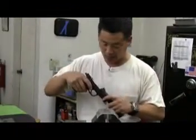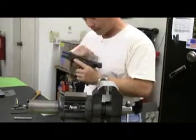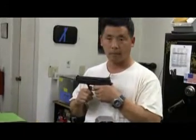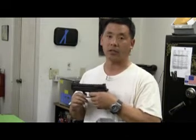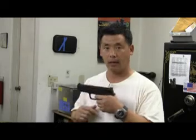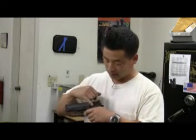Now we can reassemble the slide assembly and just check the function. So when I release, you can hear it, but more importantly the translation from the RAM movement causes more vibration to travel forwards through the trigger bar to the trigger. It also resonates because the larger surface on the RAM on the left side impacts the aluminum plug and transfers along the opposite side of the frame.